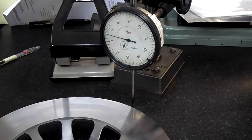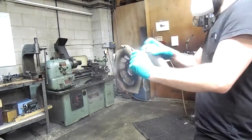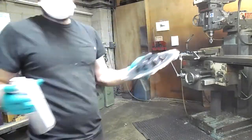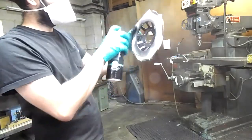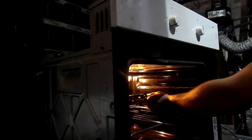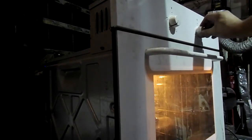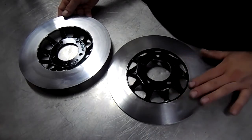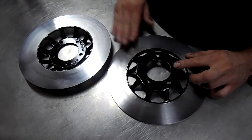So what I'm going to do now is skim the other disc off camera and then paint the inside part. So that's both discs skimmed and painted and they look pretty good. I sprayed them and then baked the paint on so it's a little bit harder wearing, and I've measured them to make sure that all the faces are still parallel even with the layer of paint.